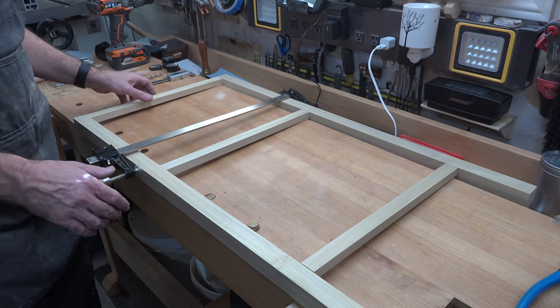I've got the one side done. I'll route the other one off camera, dry-fit it, and then we're going to turn our attention to a different section of our build. Unfortunately that's all the time we have for this week, but we've made a lot of great progress. There are a lot of different processes happening in this project, and you can modify them to make them your own — if you don't have a doweling jig or dowel centers, careful measuring and center punching will do just fine.